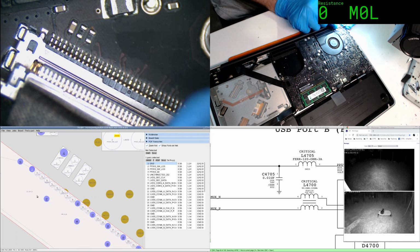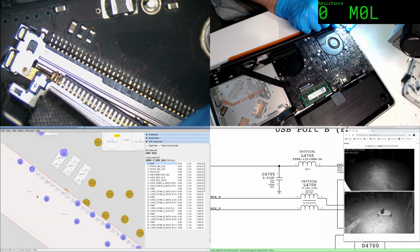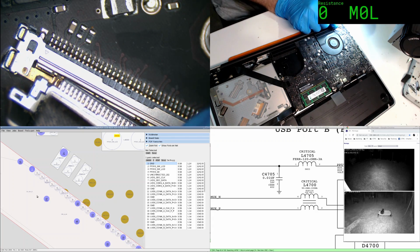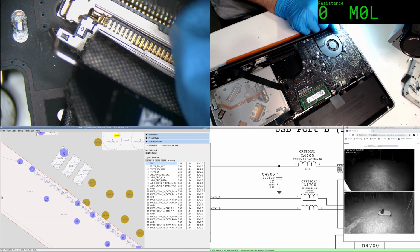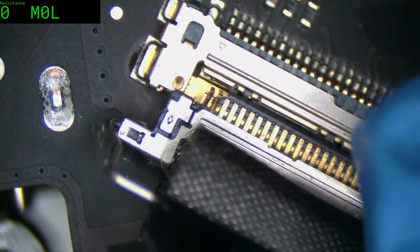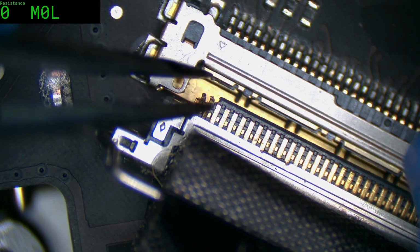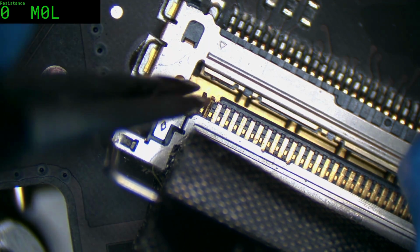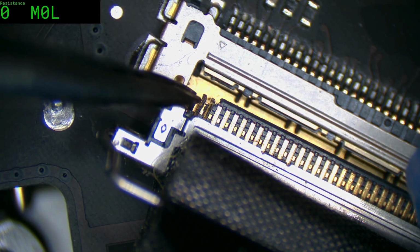So I guess it's a gamble of, do you clip those two pins off for safety, or do you try to reconstruct it? Now, I suppose the reason why it has been working in this case, and it's been some really good luck here, to be honest, is that we don't want the 3V to short to ground. Unfortunately, there's a little bit of plastic still under it, so that's been preventing the short. And this pin here, well, that is ground, so if it does short, well, whoop-de-doo, it shorts to itself. It's not a problem at all.